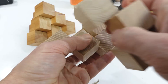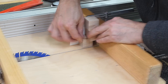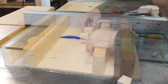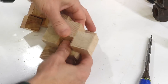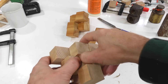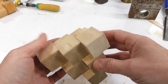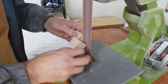This fits in here but I don't have enough room to get that between here. So I'll take a little bit off some of these cubes. This face needs to have a little bit taken off. That fits better but it's still too tight between this face and this face, so I'll take a little bit off of that. Finally got it loosened up enough so it assembles easily. Only after the fitting do I round the corners, because those round corners can mask a lot of problems.